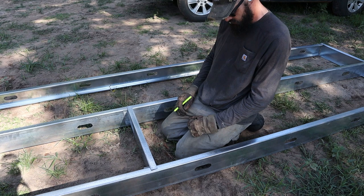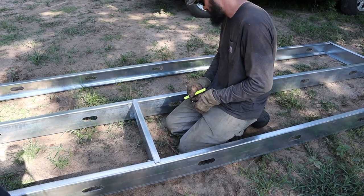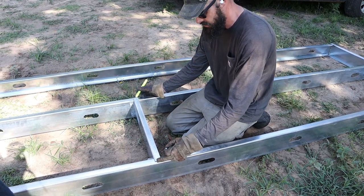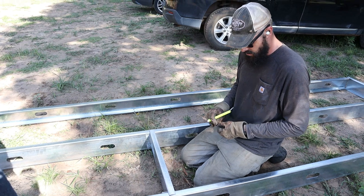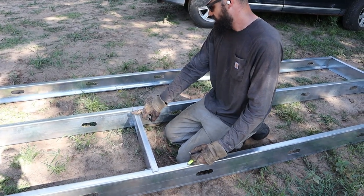Look at that. Nice. Not nice enough. Well, the front of that one's not lined up. The problem is this is longer than 2 feet now. This is exactly 2 feet, and we're sticking out a half inch on either side, which is going to warp our frame outwards. So we need to cut these another half inch on the front and the back.